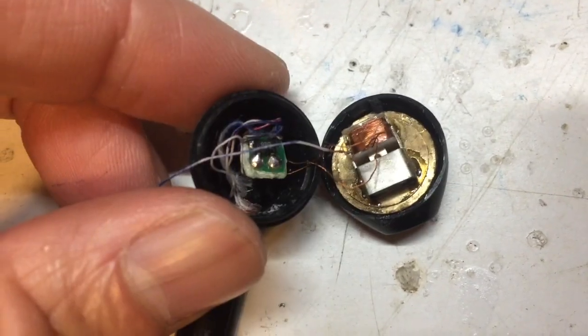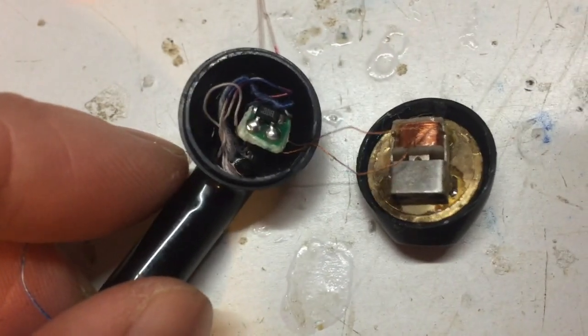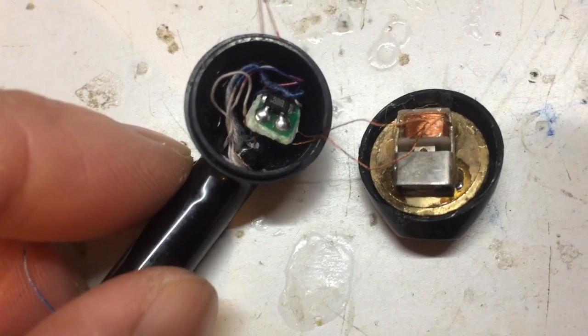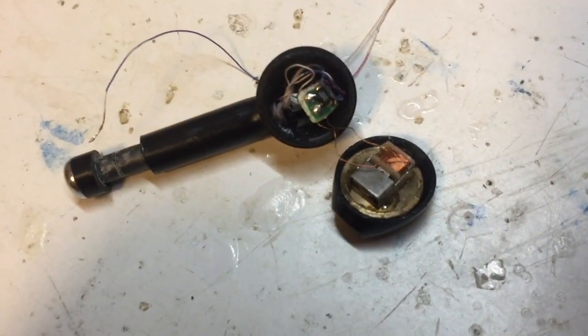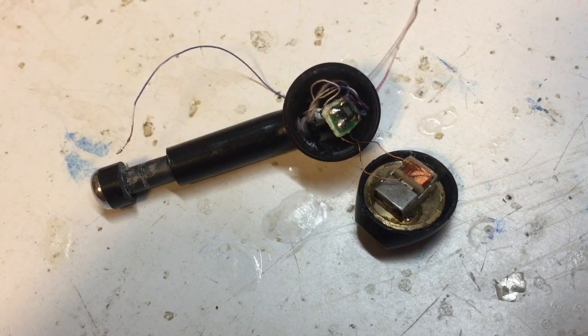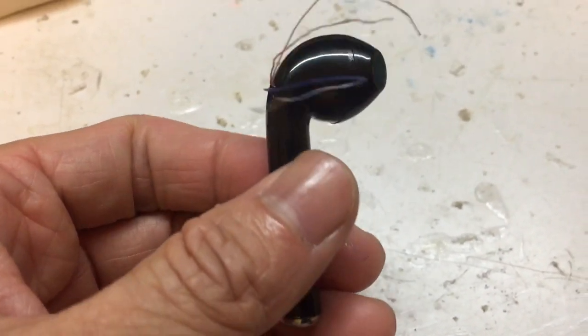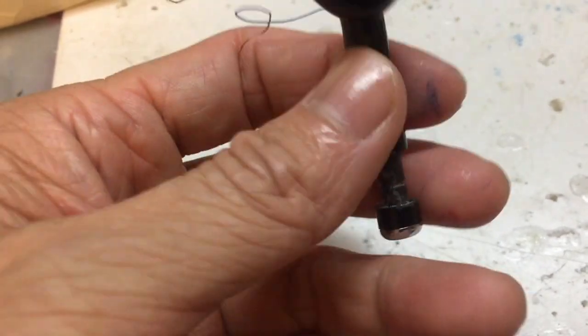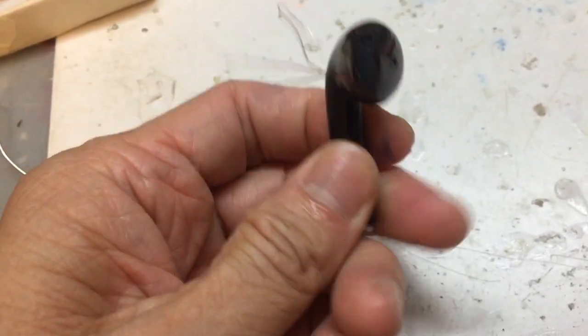Finally, after testing with the external speaker, I connected the internal speaker to the earbud. Because I can't hook it up to the microphone I can't show you how good it sounds, but it's quite good — I can listen to the radio through this internal earbud reed speaker. I just need to connect the two wires from the earbud to the antenna and the ground and then I can listen to radio. It's one way of making a crystal radio easier to use in your daily life. Hope you enjoy it — please subscribe and share with your friends.